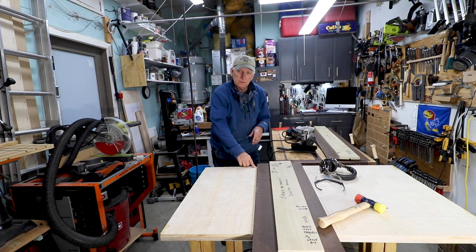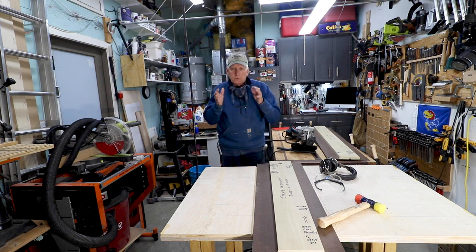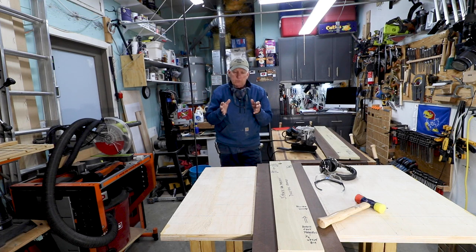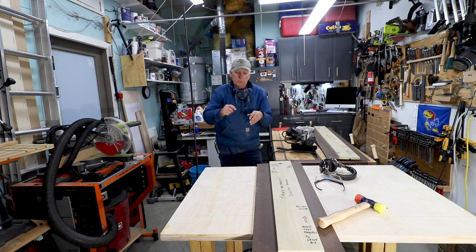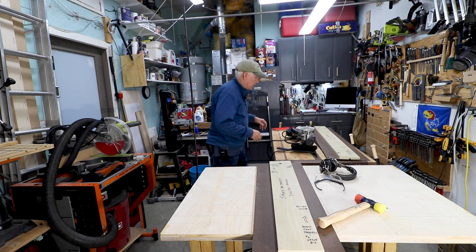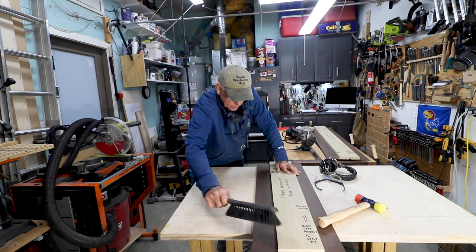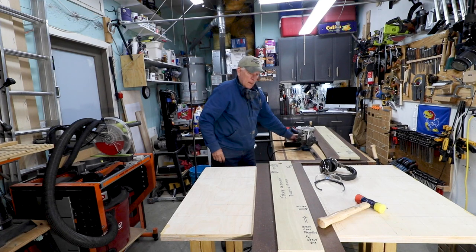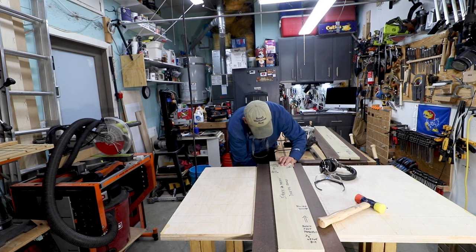And then that allows me, and I'm going to test it very, very carefully, because the real secret here for the double cut of the grooves is to get them perfectly aligned and get that dovetail bit perfectly centered in your preliminary cut. If you don't, you'll find some problems with your dovetail clamps. So it's worth taking the time to make sure you're set up very well. So let's get all the debris out of the way here, and get this aligned just perfectly.